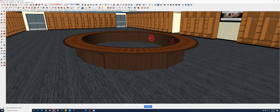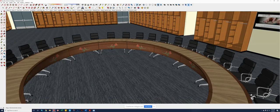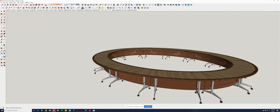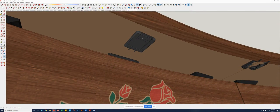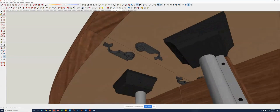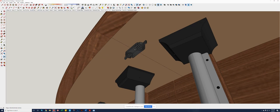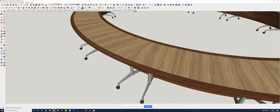So there's that enclosed option versus the modular option. To get into some of the details about the modular table: on the backside of each of these tables, they roll and fold down. There is a handle on this side of the table — you grab that handle, pull it, and that rotates the top and folds it over. The way that the tables are connected together, there's ganging hardware that's pre-installed and lives on the underside of the table. You rotate each of these together and it closes and locks those tables in position. It does two things: levels the table tops to each other because they're snug to the underside of the top, and also pulls them tight together so that you get a nice seam and all the tables are assembled — you get a nice flat surface throughout.